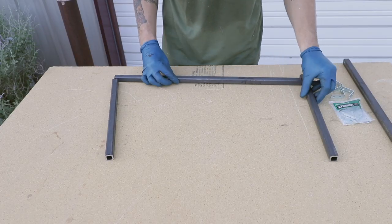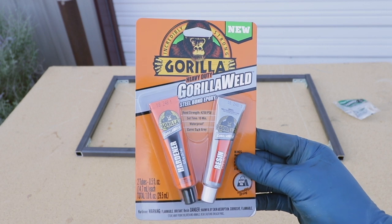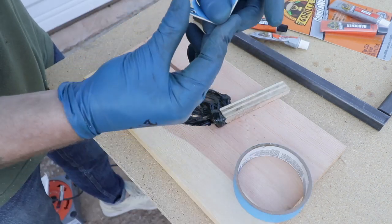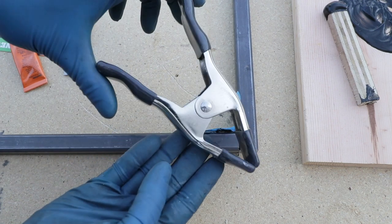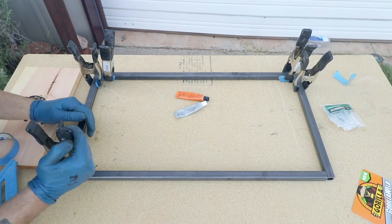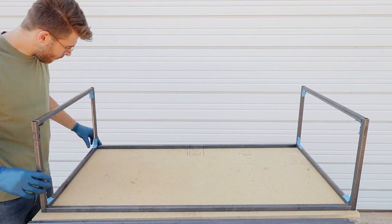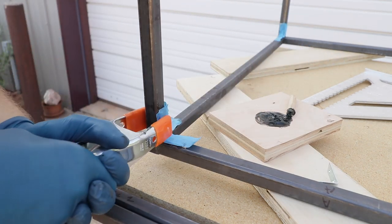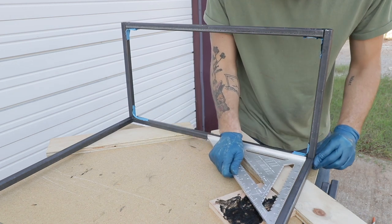To attach all of my leg assemblies together, I'm using corner brackets that I picked up at Home Depot. To adhere everything together I'm using a product called Gorilla Weld from my sponsor Gorilla Glue — it's an epoxy adhesive designed specifically for attaching metal together, and I was curious whether it'd be strong enough for a metal base. After applying masking tape to the face of each corner bracket, I could spring clamp them all together. The only power tools I used were a circular saw and drill for the tabletop, and an angle grinder for the base. You could weld this base quicker and easier, but I love the idea of a no-weld solution for people who don't have a welder or the space. After a leg assembly fell off the table and stayed intact, it confirmed this thing is sturdy.